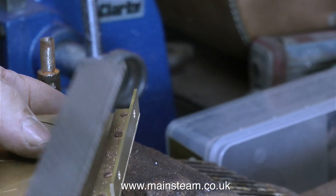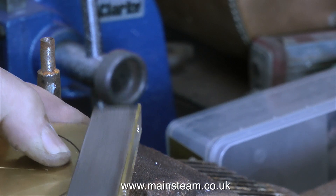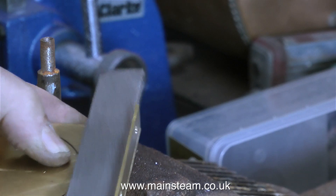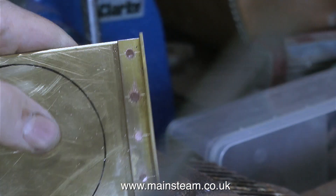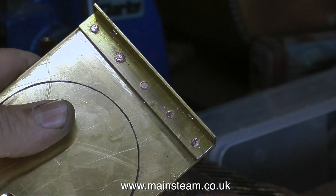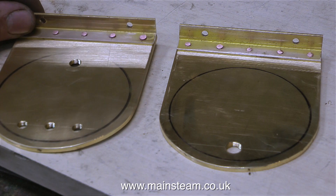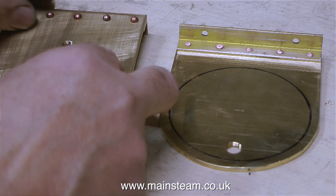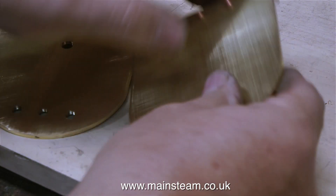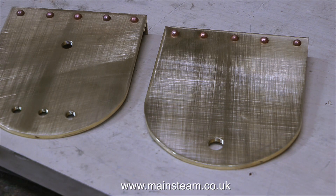This is a safe edge file — a file that doesn't have any teeth on one side. I'm using this to make the flattened parts of the rivets exactly the same size, because I cut these with side cutters freehand and cleaned them up on the belt sander, so they weren't exactly the same size to start with. In this application I'm not concerned with the rivet heads on the inside — I'm concerned with the ones on the outside, which are not damaged and they look good.